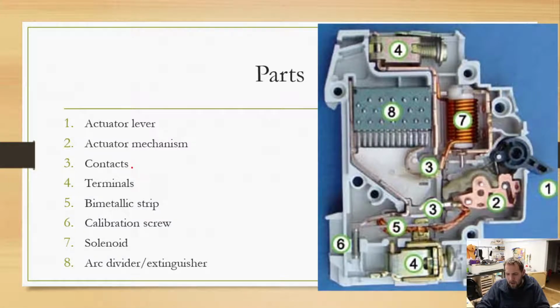All right. So here we have a bunch of different parts of a circuit breaker. Now, this is not a US circuit breaker. This is probably more of a UK, maybe Europe style. It's meant to be mounted to a DIN rail, and a DIN rail is basically this little C shape that would go in here. That way the circuit breaker would hook on the top and then it latches on the bottom normally with something like that. That holds it in, and if you ever need to replace it, you can pull the little latch away this direction, and then you can pull the circuit breaker off, slap a new one in, connect your wires up, and you're good to go. So not a US style here. I like this style. You might see it in industry on some DIN rails. That's where a lot of DIN rails are, but not a standard US style.